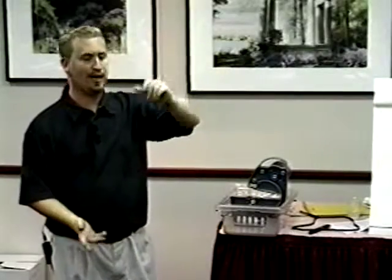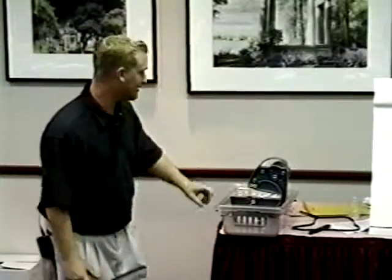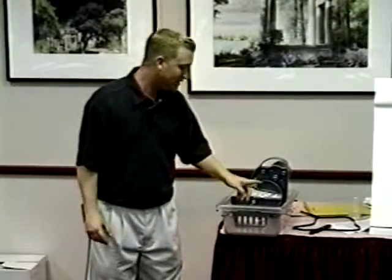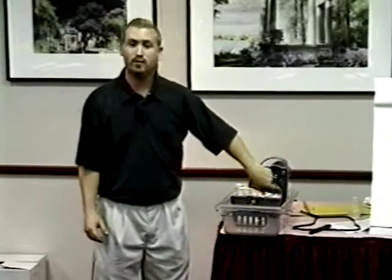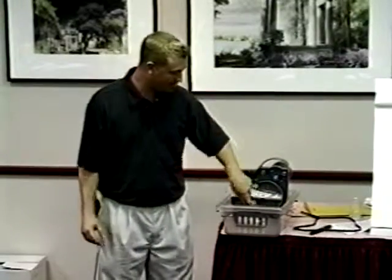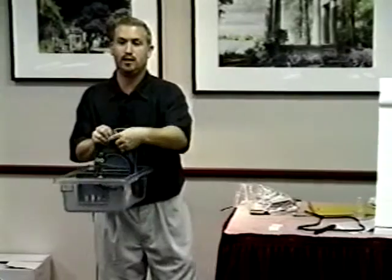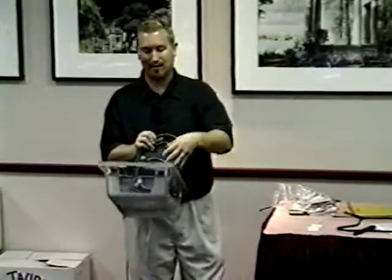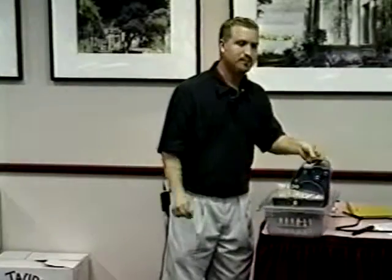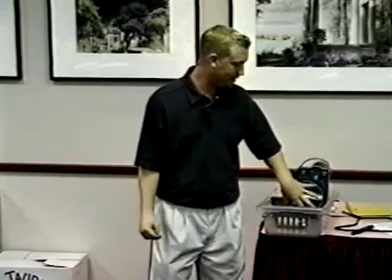With band saws that's adjustable. With us, it's what I call a static tension — actually a fixed tension. That fixed tension is the diameter of the ring, where those raceways are. That backwards C shape you see in the saw — we set that tension by setting that diameter. It's a fixed point; it stays that way unless something happens to it.